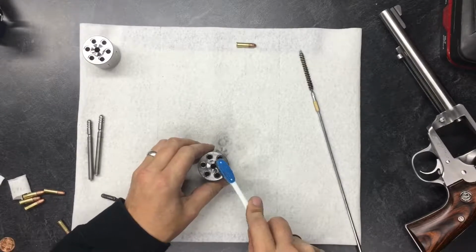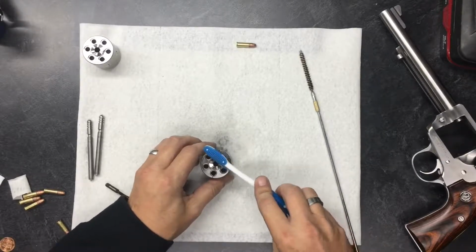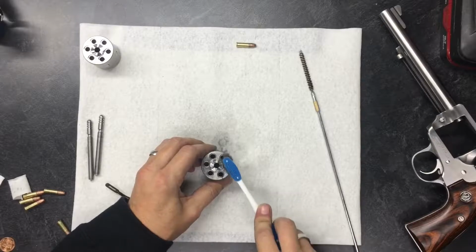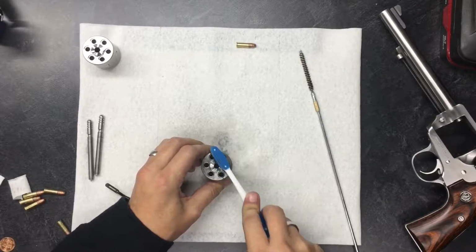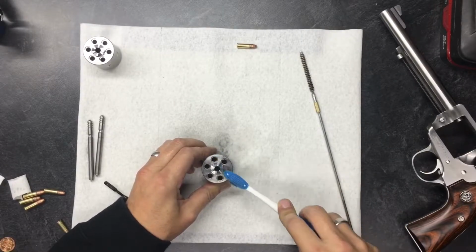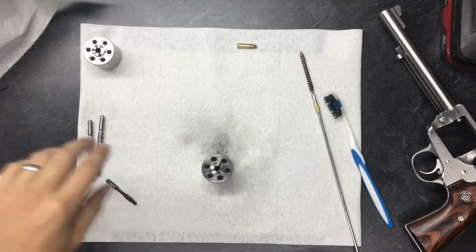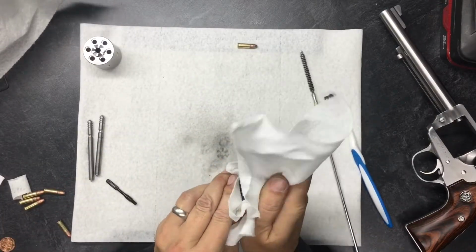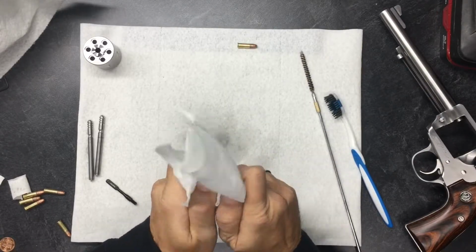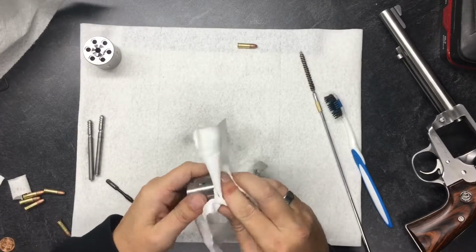And if you guys have ever done any polishing on stainless steel, if you've got, you know, swirl marks or what have you, it really takes quite a bit to get those out if you've scratched it at all. So you can kind of tell you really have to work at polishing it quite a bit to take much of the metal off at all. Let's get this wiped down here. So this is my preferred way to deal with it. We just want to make it smooth and take off just a little bit of our sharp edge, just so that it doesn't scrape anymore.